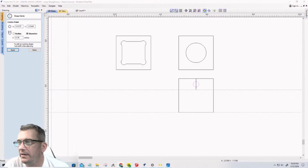The required diameter, let me see if it tells you here. Yes, it does. So the outside diameter it recommends is 10.5 millimeter, 0.413. That's the outside threads. That's not, I'm sorry, that's not the cut. Give me just a second here. That's the outside threads. We don't want to do that. The insert will just fall right through. Give me just a moment.